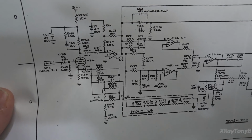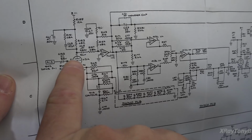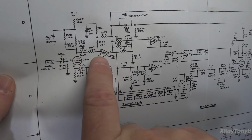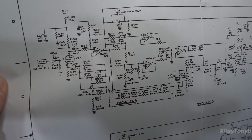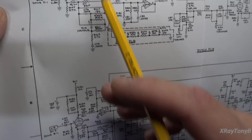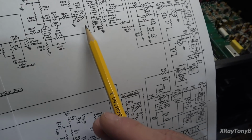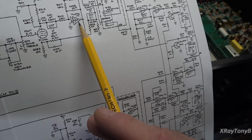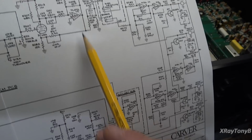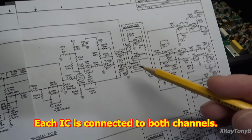Okay, so just for a quick review here, you have these two coming right off of the plate, these two op amps. They're TL072s, and it's U9, and those control the first stage, right and left channel, and then there's U12, and they control the second stage there. Hope I'm on camera. And I believe it was U12 that was causing the problems.